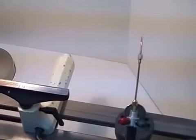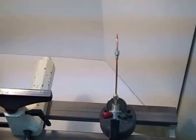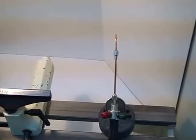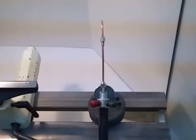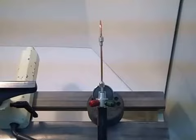As far as the torch itself, we have the Smith mini torch. My kit was the 23-1014 series, or model number. Smith is a manufacturer that is made in the USA. Outside of the basic torch equipment, I have the three inch extension and the number five curved tip on it. I use that where it makes it much easier to get inside the barrel.